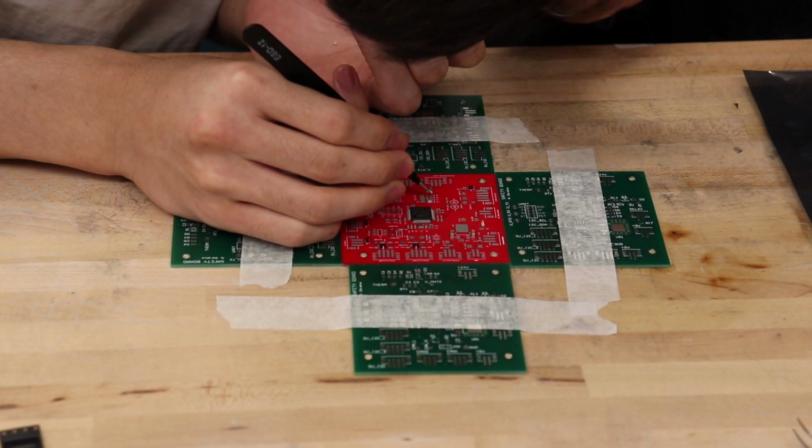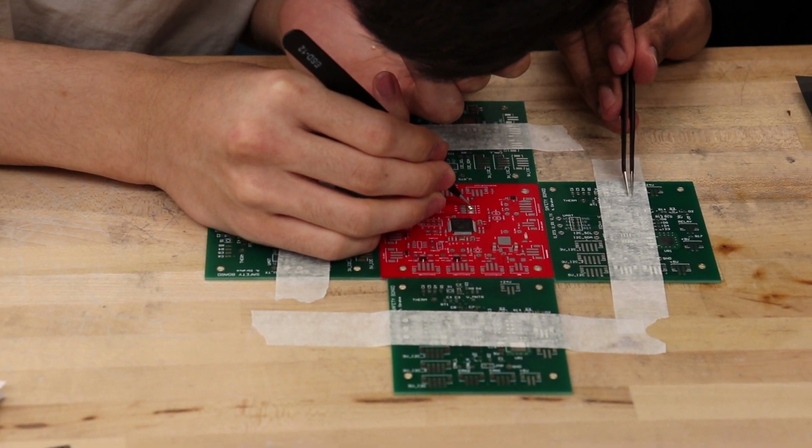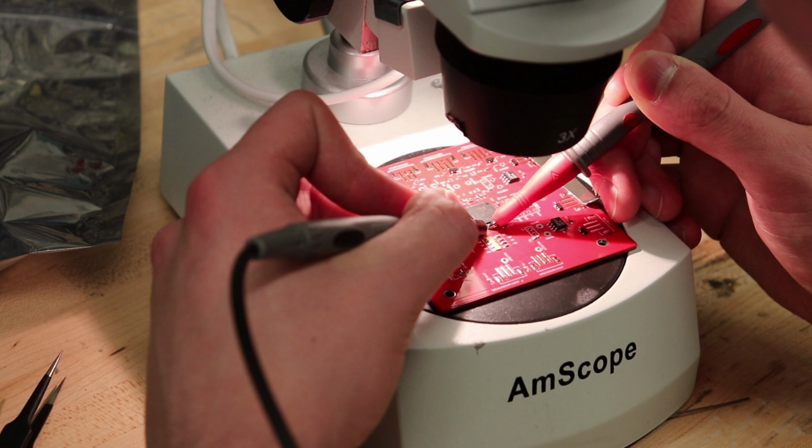A new addition to the rover this year is the safety board, which monitors the various voltage rails of the system, as well as reads the output of 6 current sensors that monitor the current through the motors on the current module. This year, the team re-architected the rover software from the ground up, with an emphasis on reliability and robustness. We wanted to make sure that the rover's performance across all the tasks were stable and consistent, implementing contingencies as countermeasures to potential system failures.